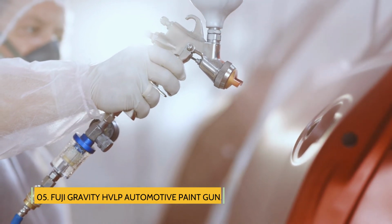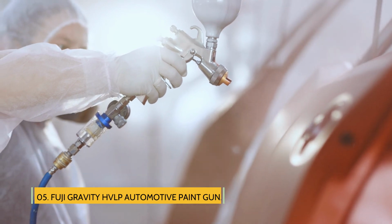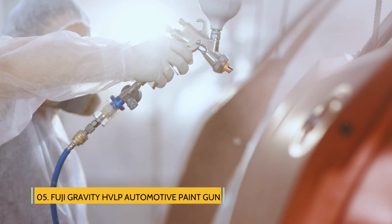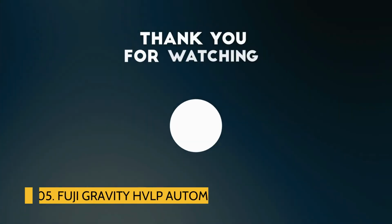Despite its tough structure, this paint gun has a few downsides. The nozzle is prone to clogs, and the metal exterior will rust easily. Clean and dry the paint gun regularly, storing it somewhere dry to prevent premature wear and tear.